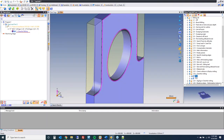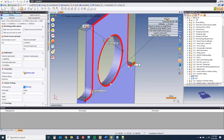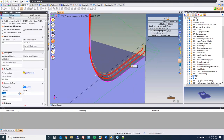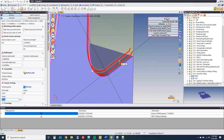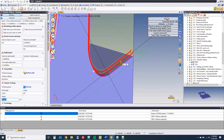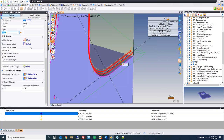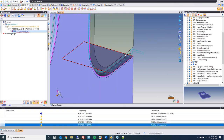A change to chamfer milling: before, you had to describe negative values for the chamfer. Now it's inverted — you type a positive value, like 1mm, and it automatically compensates to an altitude of minus 1. If you change the flat length to half a millimeter chamfer, it goes to minus 0.5 automatically. Additionally, you now have the possibility to do zigzag chamfering, getting rid of some rapid moves — come in, machine back, and off you go.